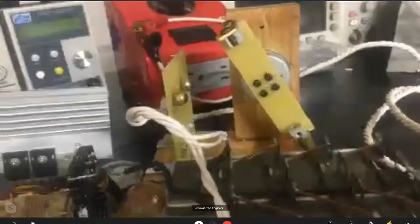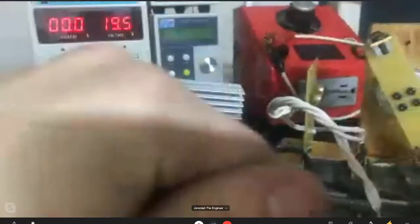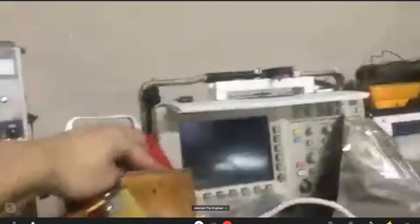That's the capacitor bank. That's the CCFL modified transformer and the ZVS driver. This is the pre-charged bank, and then that goes through a single rectifier, through a full bridge, and then through an inductor, and that creates a charging network, which offers a pretty high charging efficiency to the whole system. So we'll flip this on, and like I said before, you won't be able to hear me much when this is running, but it is what it is.